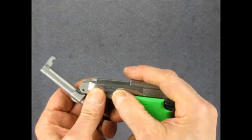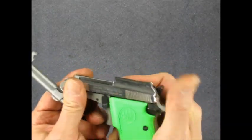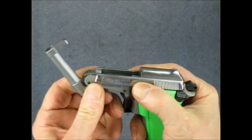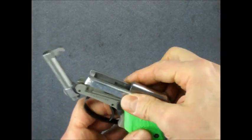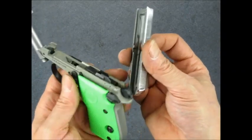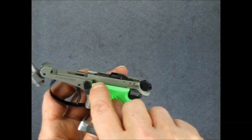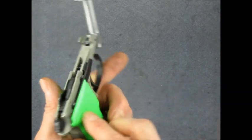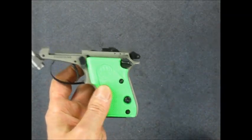This piece just pops off. You've got to push back a little bit — it's actually easier if the hammer is cocked — and then it comes right off. Then you just pull it forward and pull it out. Look, there's no spring visible here. This is actually the spring right there, that little thing sticking up. There's one on each side. Let's see how they work.